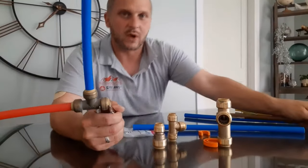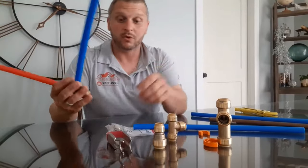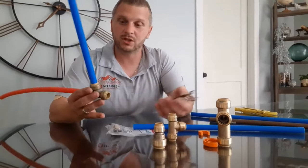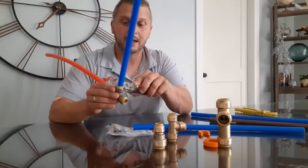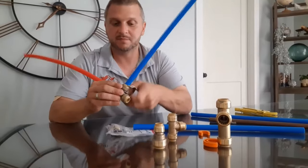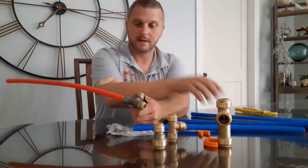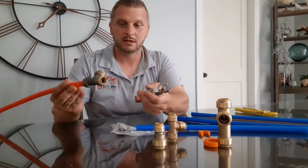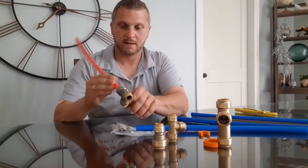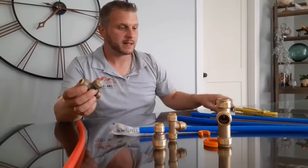It's still a great idea to clean your copper before you stick it in, like you would if you were soldering — with sandpaper and everything. For PEX, just make sure that it's a clean cut, because it just seats better. Same thing — it just pulls right out. So you can reuse these just about anytime you want, or if you had to do a quick repair.